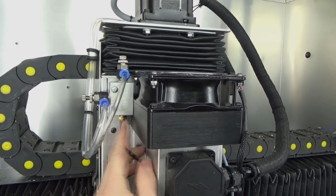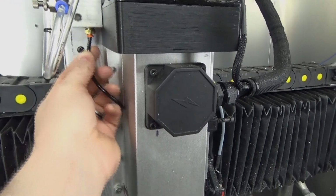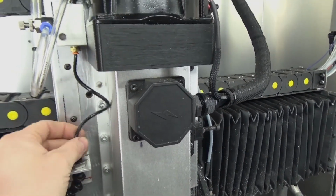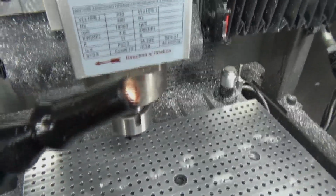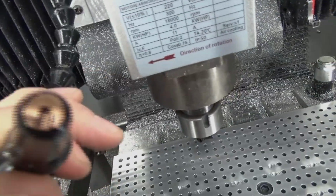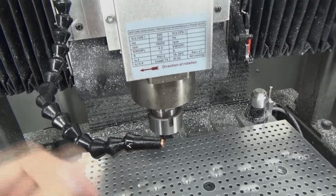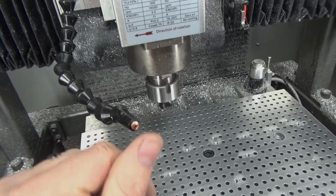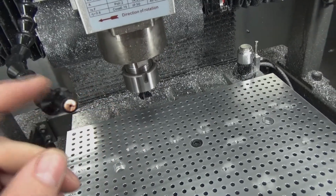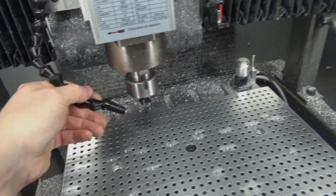and there's a very tiny bore in here. And this is another push connect line, very small. I don't remember the size off the top of my head. That comes in, and I actually used a tip for a MIG welder and turned down the other end to make a barb out of it and push this onto the barb. And that works fantastic. It was just a perfect fit on the inside of this 1/4 inch lock line. I put a little glue in there, and that's it, and that's worked fantastic.